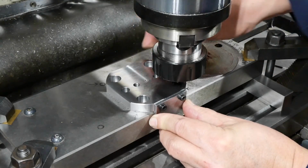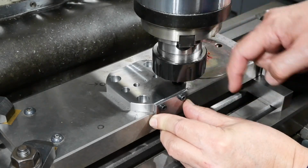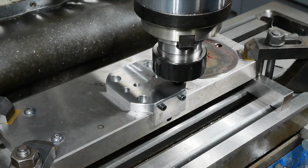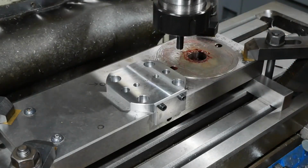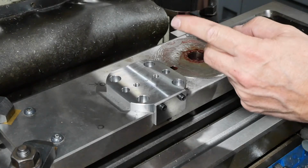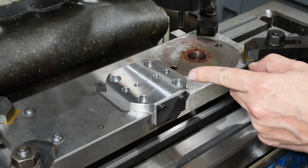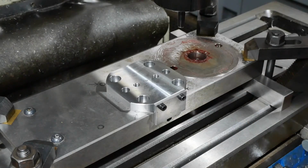So I believe I've got the dowel pins centred in the hole such that there's an equal amount of movement fore and aft on the screw. I'll drill the hole with a drill in the collet chuck rather than using the 3-jaw Jacobs chuck, just because this will be slightly more accurate, and anything which helps to guarantee that the hole finishes up in the correct place is a good thing to do.